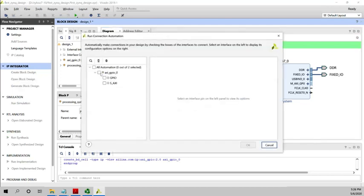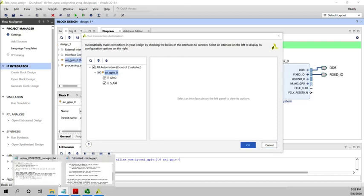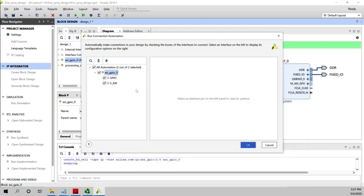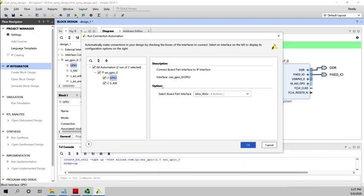See, you have to click on all of them. One important part, and it's already mentioned in the tutorial: you have to configure the GPIO, because, as the name implies, this is general purpose input and output, which means it can be an input or an output, right? And you have to configure what this is. So you have to click here on GPIO, and you just click on what you want.